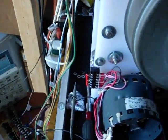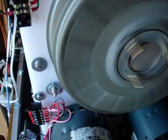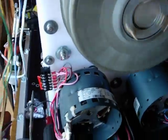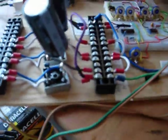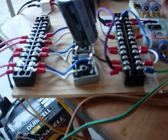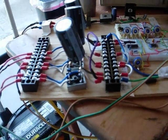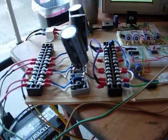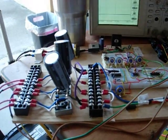The FETs aren't even warming up at all and it's very smooth. I had to readjust the whole motor again, but this is quite amazing. Down here I've also got the pickup coils connected, and what I'm getting across the three caps in series for the three-phase pickup coils is about 306 to 340 volts total — a nice solid DC output.